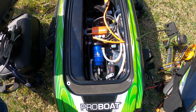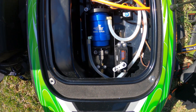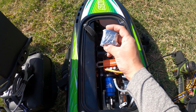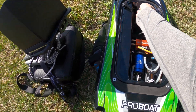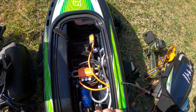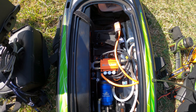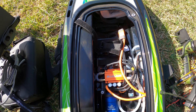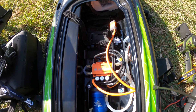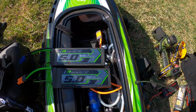She is 8s capable now but I'm still waiting for the HD flex cable — still got the stock flex cable and it's already showing a little bit of signs of wear. I also got this GNSS performance analyzer, which is freaking amazing. I was really disappointed with my GPS system, but the difference is gigantic. The regular GPS updates about every three seconds; this one updates ten times a second, so it should make quite a bit of a difference. I'm going to try the 6s 75C batteries right now.